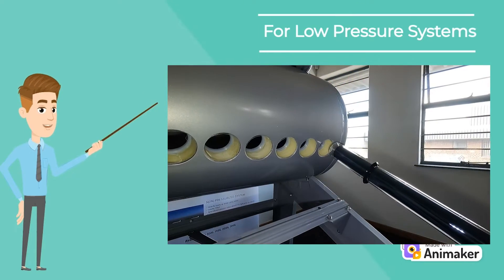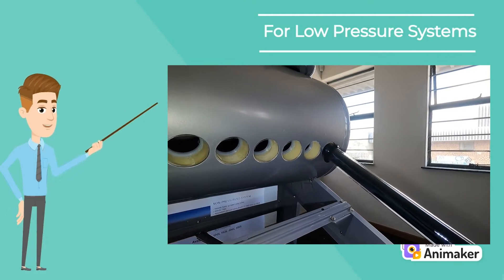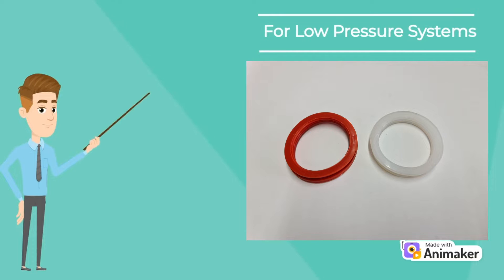After preparing the vacuum tubes, firmly push and twist the tubes into the tube opening, just so the bottom clears the tube holders. Please do not force the tube in if you encounter significant resistance, as you may dislodge the inner rubber seals. Rather re-lubricate the tube and inner rubber seals again and try to adjust the tank angle before trying again.